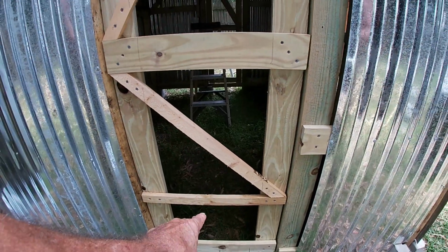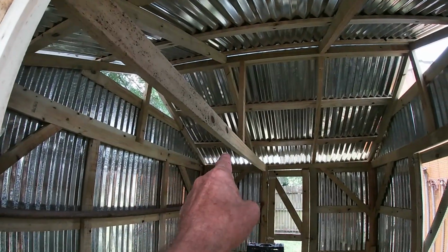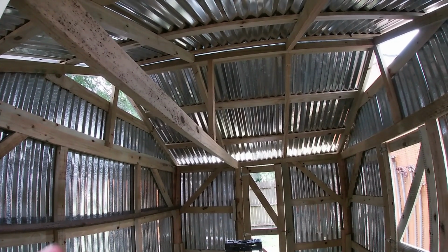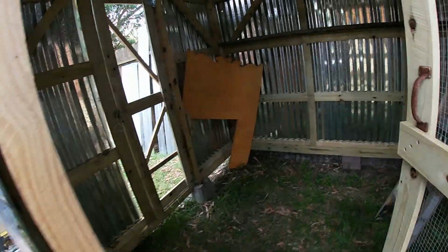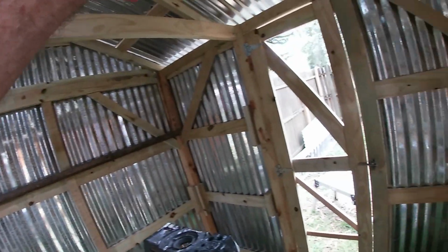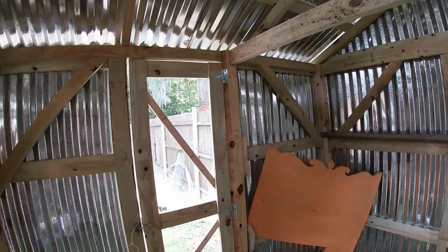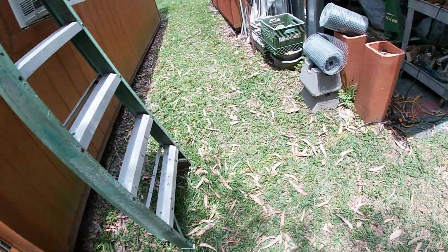And these are where the chicken doors will go, one on each side, and we'll mount that actuator up in the middle, and that sheave that's on the actuator will turn and pull the chicken door up on both sides at the same time. And if you only want one side to come up, you can unhook the rope, but we'll use little pulleys. And as that shaft turns, a rope tied to it would go down using little pulleys to pull the door up and down, and do the same thing over here. So that's just a little bit of ingenuity engineering.